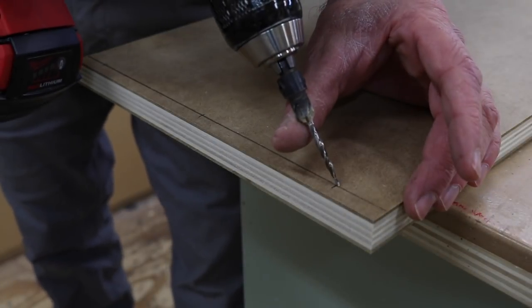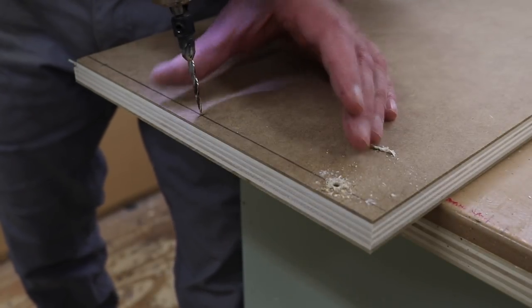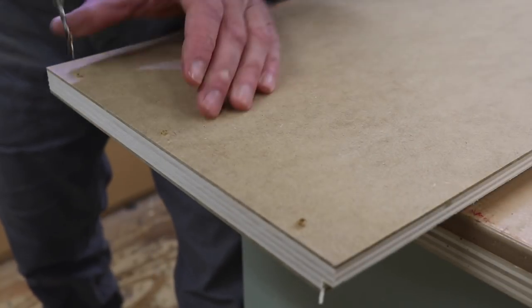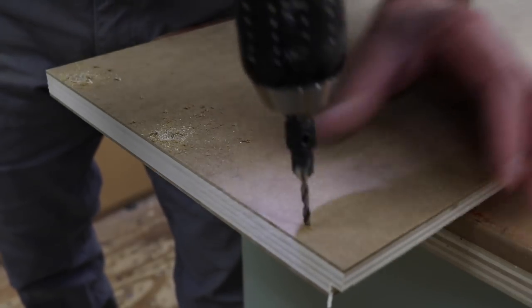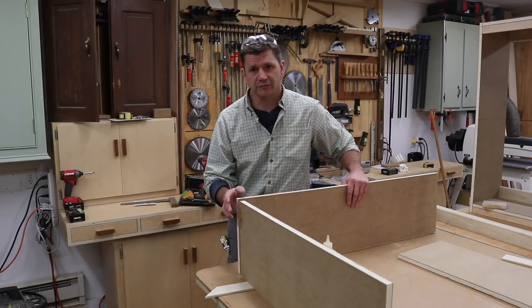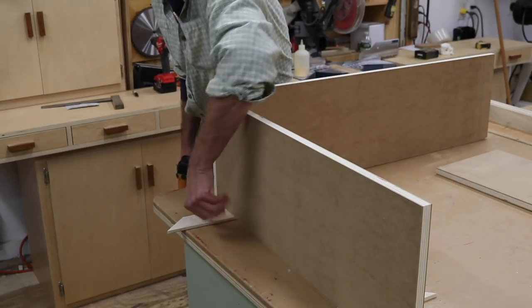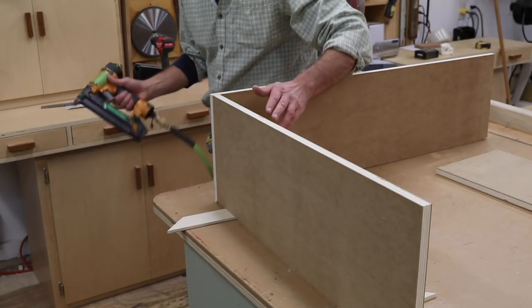At the top of the cabinet I attach the top flush with the top of the side. I've measured, marked, and now drill holes through the inside of the cabinet, flip the side over and countersink the holes. Now I'm ready to attach the top and bottom, building the cabinet with wood glue, tacking parts in place with inch-and-a-half nails, then using inch-and-five-eighths screws for a stronger joint. The top is propped up with quarter-inch shims because the sides are a quarter inch deeper than the top and bottom, to allow for the back of the cabinet.